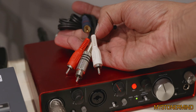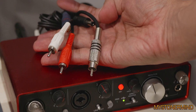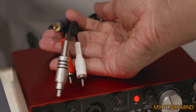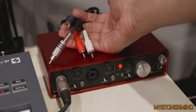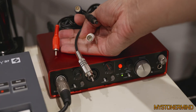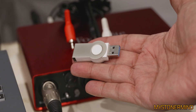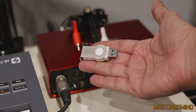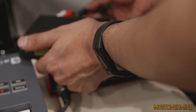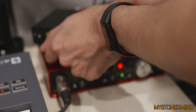We've got these bog-standard RCA cables - the red and white ones - going into the back of the Shake EQ. Then we have this silver one going to the shaker amp. This blue one is a Y-splitter going to the DSP for the sub, and this black one is the power for the Shake EQ. We also have a USB which you might need if you're going to be doing some advanced stuff, which is what I've done. The subwoofer goes to output two, main output is the shaker, and then we have power.